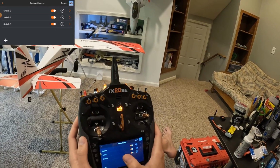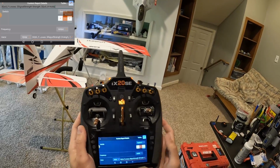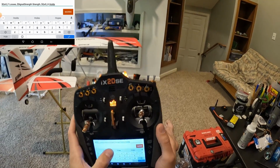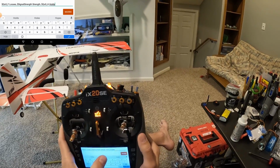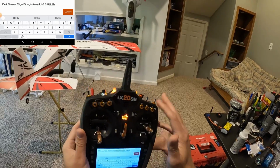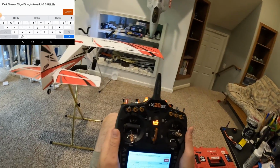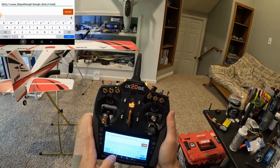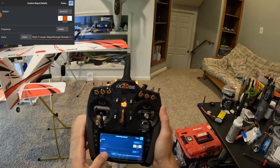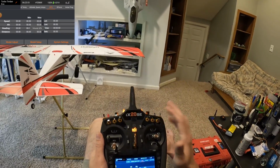On mine, I also have it set to call out the current signal quality. So QoS_F losses, signal strength, and QoS_H holds. That all tells me this: "0 losses, 100% strength, 2 holds." The 2 holds come from unplugging the receiver or going into forward programming. All sorts of different stuff can cause a hold, or just crappy connection quality too. That is basically all there is to getting the radio to tell you what your voltage is on a timer.